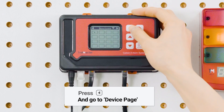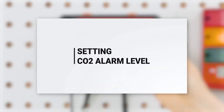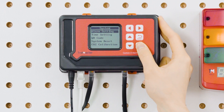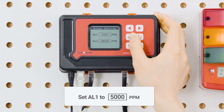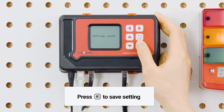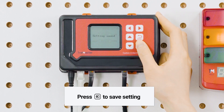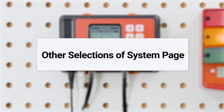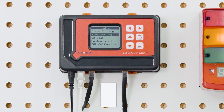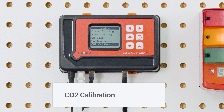Click left to access the device list page, and click right to access the alarm message page. There are other settings within the system settings page that allow the user to determine the CO2 alarm level. The preset level for the low alarm is 5,000 ppm — press Enter to save the settings. The high level is 30,000 ppm — press Enter to save. Additionally, other selections within the system settings page include the system time, options to update firmware, factory reset, and calibrate your CO2 sensors.